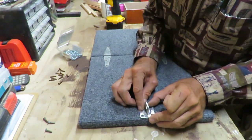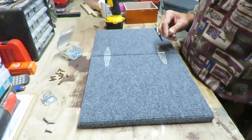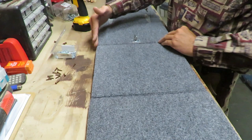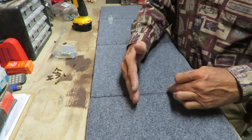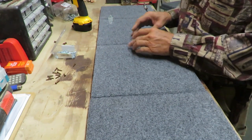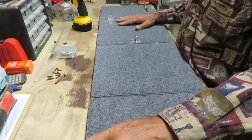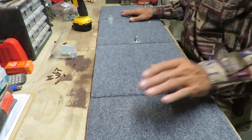I'll put this clevis here and measure to the center to make sure I can close it — I'll put a padlock on it and lock it. I have this one done with everything attached. I laid these the way they're going to be on the boat to make sure they're perfectly even on the edges. I'll put two hinges here and the other half of the clevis to close it. Then I'll do the other side — I'll need to get some hex head metal screws to go through into the metal tube to anchor it down.